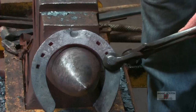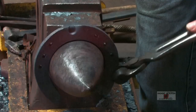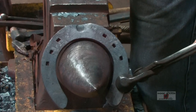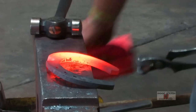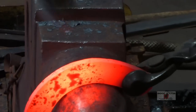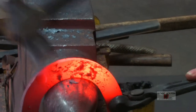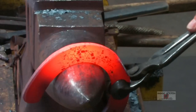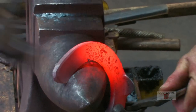I'm just going to take one clean-up piece. Since it's a hammer finish shoe, there's no need to just roll through this and try and get done. If you do everything systematic — what you do to one branch, you do on the opposing shoe to the same branch at center — you'll end up with pairs. I'm going to grab it from the heel nail and go over the horn, working away from my heel quarter and going to the extensor process where the toe clip is. Pick it up at my heel quarter, the wing of the coffin bone, the bridge of the foot, and come on around the other side.